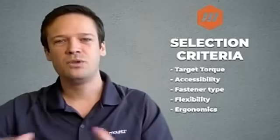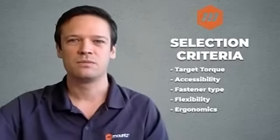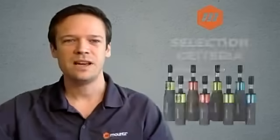So as we've seen, two main types of hand tools, screwdrivers and wrenches. So let's have first a look at screwdrivers. On this image here, we have the FG preset screwdrivers family. On the screwdrivers, different types of mechanisms exist. The first type would be a clutch type of tool with a simple ball bearing pushing on a clutch. And this will result in a harsher condition when the clutch activates, as well as shock happening on the parts.